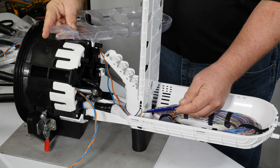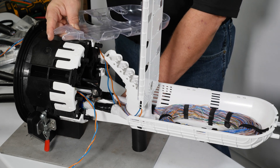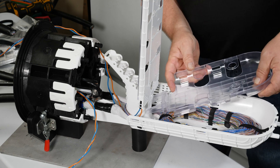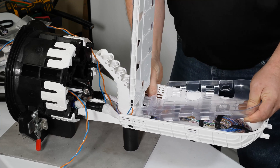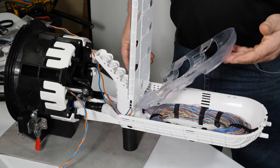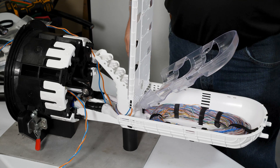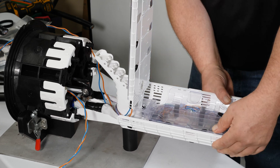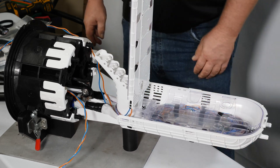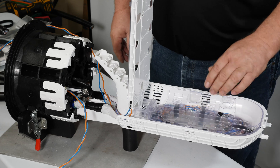The inner tray will be installed on the mounting pins below the splice tray retention on the yoke. Bring the inner basket to the yoke and set one side on the mounting holes. Rotate the inner basket and secure in the second mounting hole. Bring the inner tray to the upper position and let it lock in place. Ensure all fiber or tubes in the lower basket are secured and clear of any potential damage. Firmly grasp the inner basket and lower into place, then depress each side latch to snap into place on the lower basket. To open the inner basket, simply squeeze the inner basket locking tabs from the designated keyhole and lift.